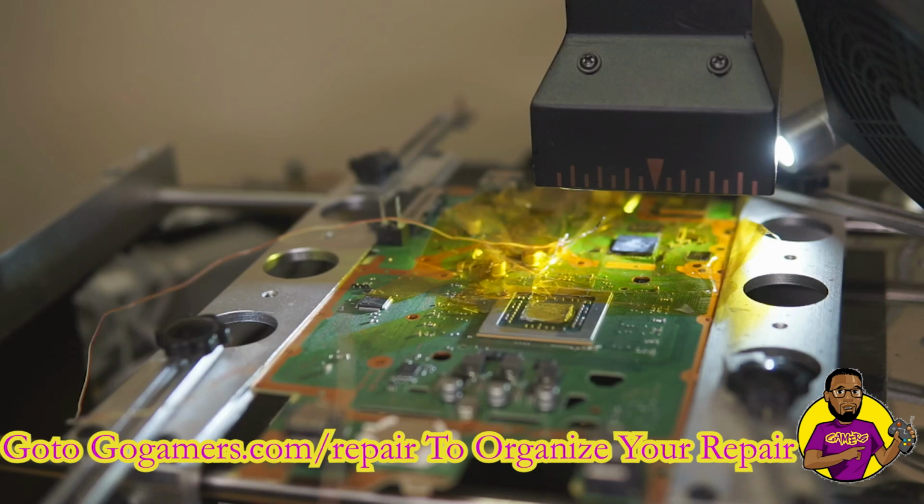All right, guys, so what I'm going to do is the push test on the Southbridge just to make sure that it is completely in place. I'm going to move the top heat out of the way, and we're going to make sure that the Southbridge is in the correct spot, and then we're going to lift the board, clean it, and put it back together. So let's see what we can get done.